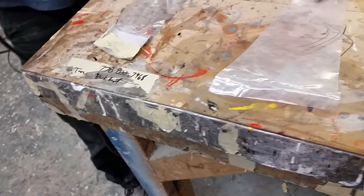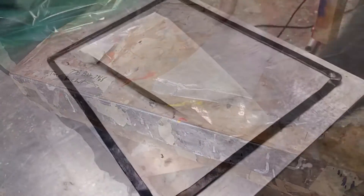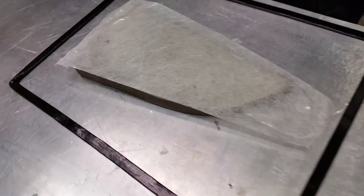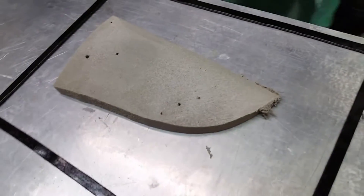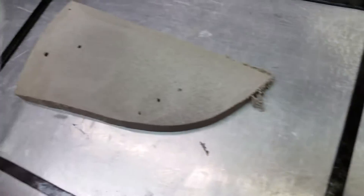But it's also twice the weight and thickness it seems. So I'm going to try and shape some CPM 505 with some heat. The way we're going to do it is we've got this table set up to basically suck down the CPM as we heat it. We have a bit of a profile here with a bit of camber, so we're going to lay the CPM over it and see how it forms with heat.